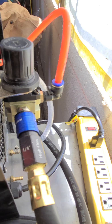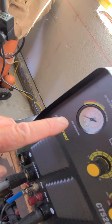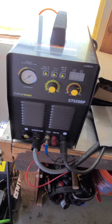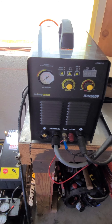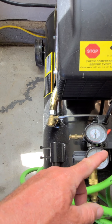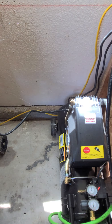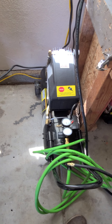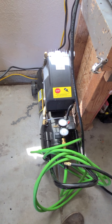I've got the compressor pinned at 125 PSI, and there's a jumper line — 10 feet — that goes to the back of the machine. You plug it in when you need to use it. The machine comes with a regulator in the back. They've got great instructions — just plumb it up the way they tell you and it's perfect. I bought some different fittings, but they work just fine. You dial your PSI up on this and there's your gauge — I set mine at 60 and it's been working just fine.